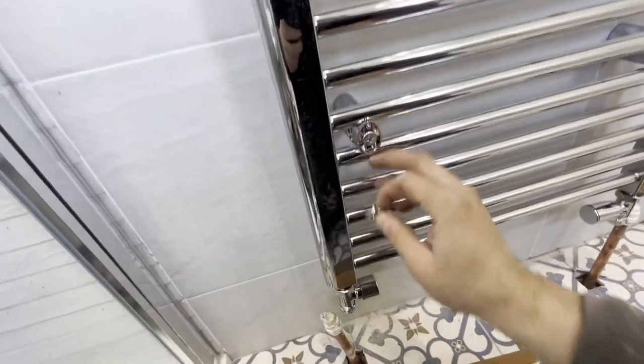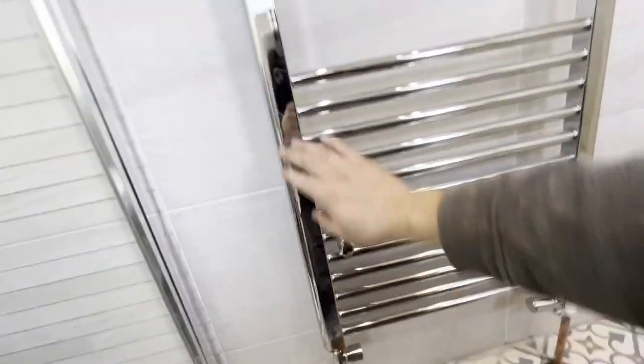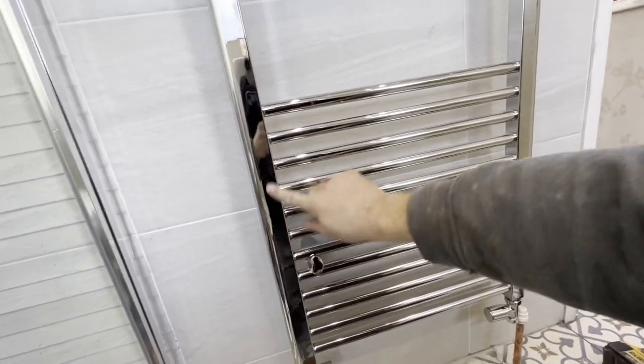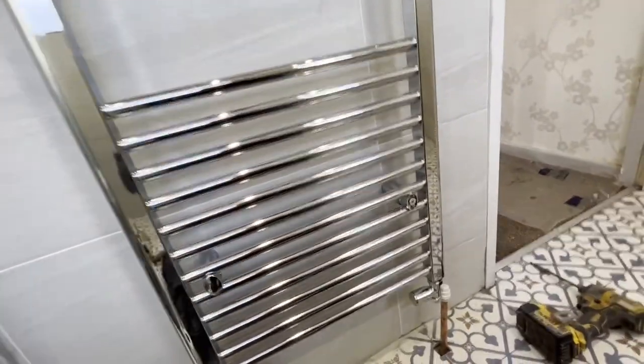I've just noticed it's got dots on it — can you see it? I'll check the other side, make sure it's not the same. I'll make the customer aware and see if she wants to change it. What we do now — there are four little screws in the bottom; you screw them in there and tighten them up and it holds it to the wall and holds the brackets. The bonus of not tightening these up yet is you can swing it to get it bang on level — same gap on all four sides. Once you're happy it's level, just nip them up. Don't over-tighten because the cap won't go on if you've squished the plastic. The plastic caps just slot in like so.